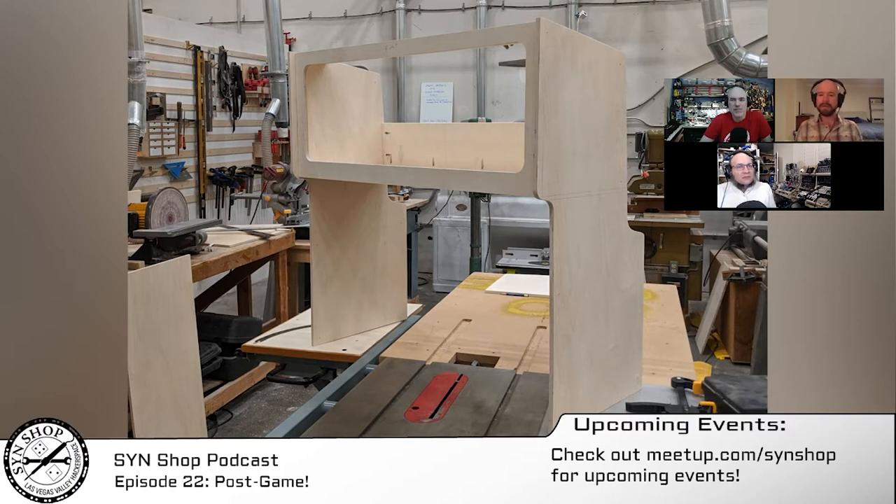The second van was nerve-wracking, wondering if all the rumors about pocket holes falling apart the moment I hit a speed bump would come true — but they held together pretty well. There are a few areas that are pocket holes reinforced with glue, using the pocket screws just to act as clamps. Other places are glued, clamped, and bradded — all three. I think my bed frame I did that on, where I needed to eliminate all flex across the entire width of the van.